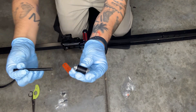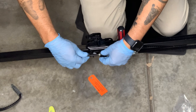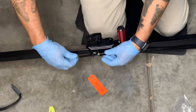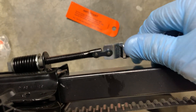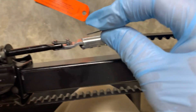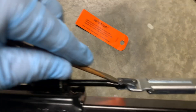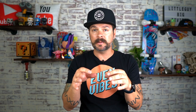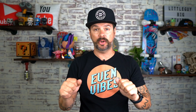Step eight, grab the master link spring and unscrew it. Then slide the screw through the hole and hand tighten it — you want to make sure there's going to be a little bit of play. On the other end of the belt you'll notice there are two holes like a bike chain. Put one end on there, and there's a little link — put it on and slide it over to lock it in place. A flathead screwdriver seemed to work okay. Once you have that secure, the belt should be completely around the motor mount and the garage rod.